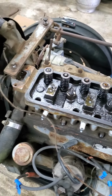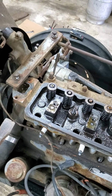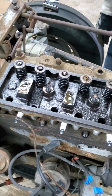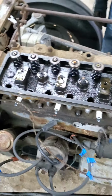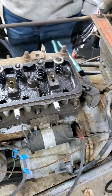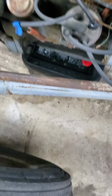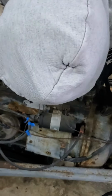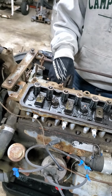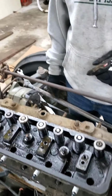So now, with all the cylinder head bolts out and the water jacket lifted up out of the way, we're going to put a pry bar in underneath the front of the head and make an attempt at prying up on it. Because of the former gasket material, it's probably somewhat glued down there. So we put a pry bar in, and we're starting to get a little bit of distance between the cylinder head and the block, but it's still a pretty tight fit coming up over all of those head studs. So we're just going to need both hands here for a minute.